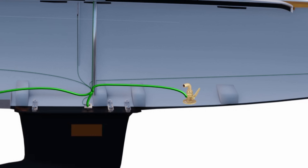However, we need to sound a caution here because for the last couple of decades we've had an awful lot of metal through-hulls for boats made from some variant of brass. They might call it de-zincification resistant brass, often known as DZR or DZR brass, but those brasses are much more prone to corrosion and they do need to be bonded. We've had multiple through-hull failures in recent years from these inferior grades of metal. This comes partially from some European ISO standards which specify they're only supposed to last five years.